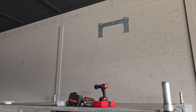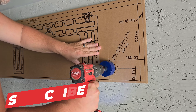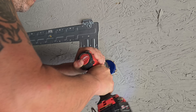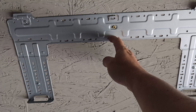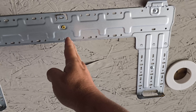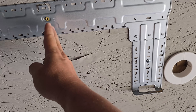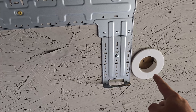You first want to hang the indoor mounting bracket and drill your line set hole to the side using the provided template. If you're 16 inches on center, you can put this right dead in the center and you're not going to hit the stud. I've got one stud here and one stud right there, so the distance between the center of this bracket and the edge should be fine if you've got 16-inch on center.